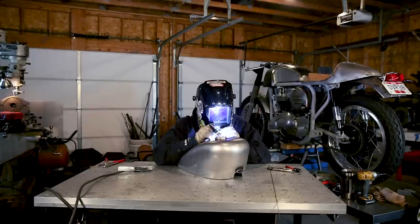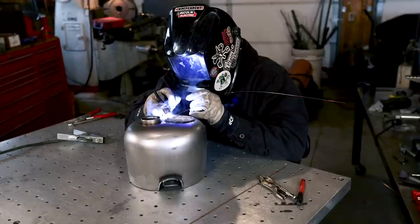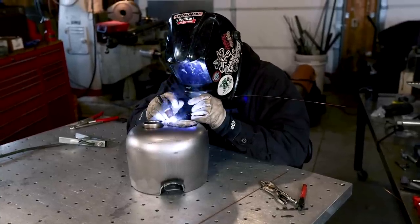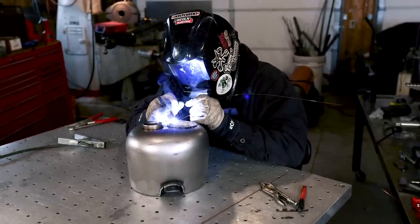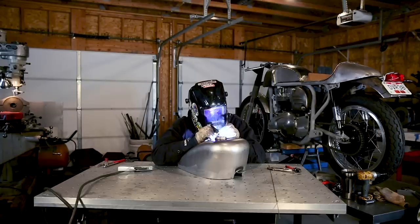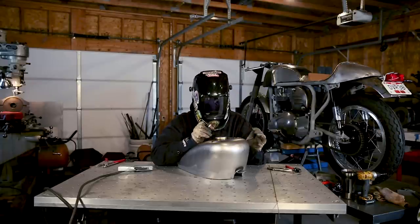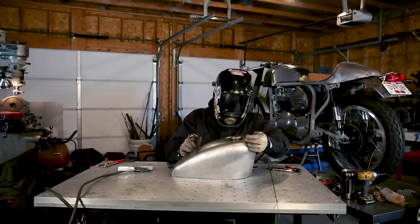One more thing, I would suggest welding the spots where you have the tightest fit first, and welding in the areas that there are gaps after the tight fit spots are welded. It'll distort the least if you weld where you have no gap than if you have gaps.